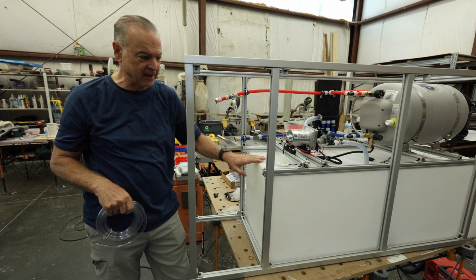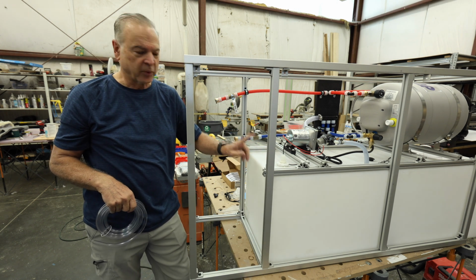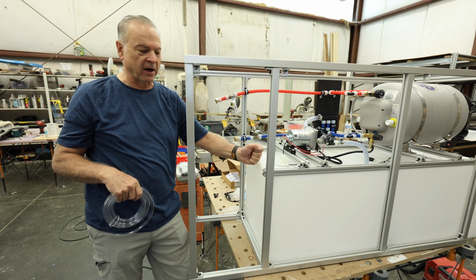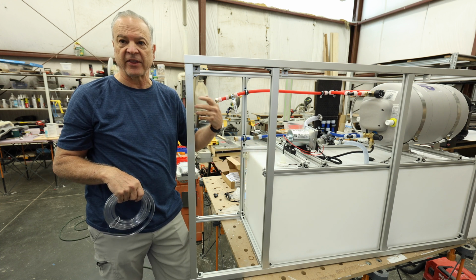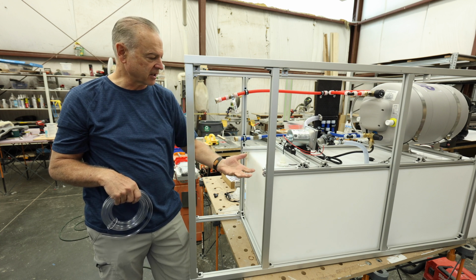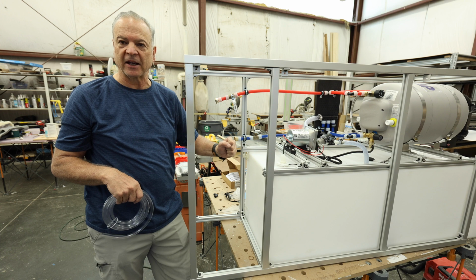So on these water tanks that are used in vans, pretty much all of them have to be vented, because when you're filling the water, you need to have somewhere for the air to escape, and then as you're draining it, as you're using the water, you need air to be able to come back in.